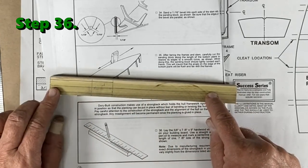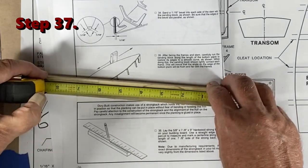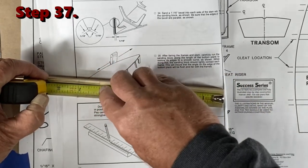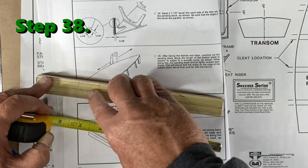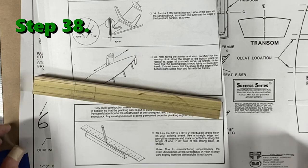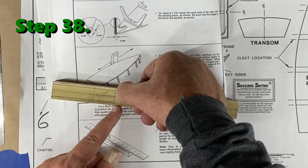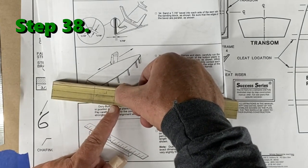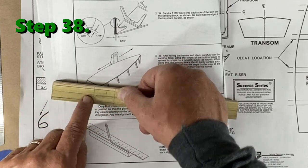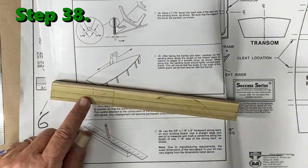From one end — you can pick whichever end — you're going to measure seven inches and put a marker. While you're at it, come back an inch to the six-inch mark and make another mark, so that gives you a one-inch channel right there. Next, from your center line up to the closer line — the one that's six inches from the end, or one inch back from the seven-inch mark — you're going to make another line on both sides of the center line that is five-sixteenths of an inch.